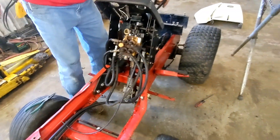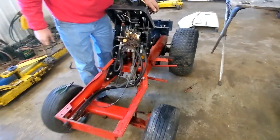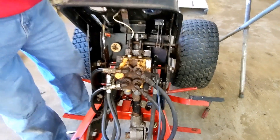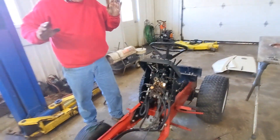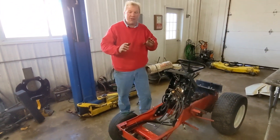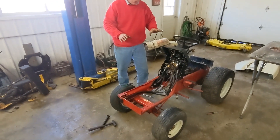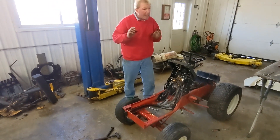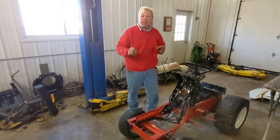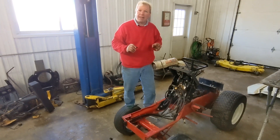Just make sure the levers and everything feel about right — and they do. Now there's a dual remote setup for a 782 Cadet. It's the same on any of them — the 1872, anything that has live hydraulics, you can put the dual remotes on. This project went a lot smoother than I anticipated. I so appreciate you tuning in. Please like and subscribe, and thank you for tuning in to Mac Land Cadets.